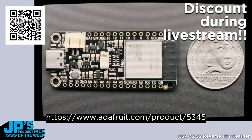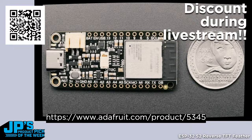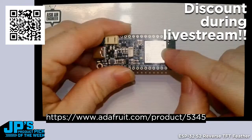Go back here. I remember there's a NeoPixel on board. There's a second regulator, so you can turn off power to the NeoPixel and the STEMMA QT port for ultra low power. We're using the RT9080 regulator on these boards, which means that the power goes down to like 30 or 40 microamperes when in deep sleep mode.